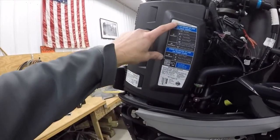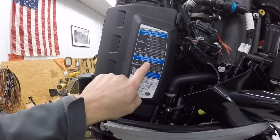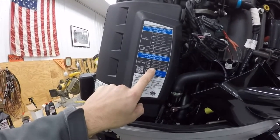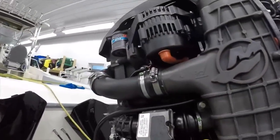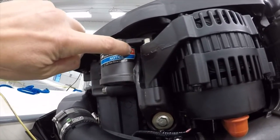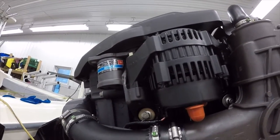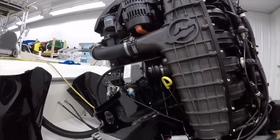Here's a nice little maintenance schedule. I'm at basically 300 hours, so spark plugs, water pump, and it says the accessory drive belt. When I looked in the manual, I think it said inspect, not replace. Based on what I'm seeing with the drive belt, it says to replace the belt when the arrow indicator is in the red — and it's not. But I'm going to buy the belt, probably run the boat a little in the spring and then replace it, and this belt will probably still be good so I'll keep it as a spare on board.